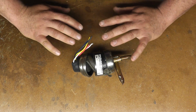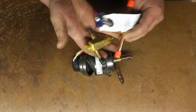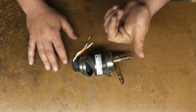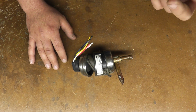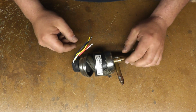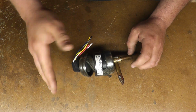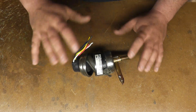Alright, so we just trashed that whole thing and ripped everything out and went back to a regular solenoid, expansion valve, and temperature control setup, because it was a friggin' nightmare. Even doing that, I still had to go out to the condensing unit and rewire the condenser, because a normal condensing unit will use a 208 volt coil contactor. In the case of the Beacon systems, everything is 24 volt low voltage controls going from the condenser to the evaporator, because the board controls everything. So I had to rewire and reconfigure the whole friggin' condenser, in addition to ripping apart half the evaporator.